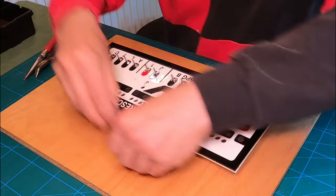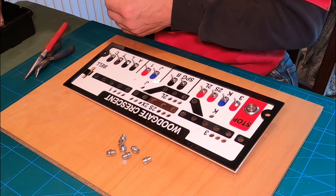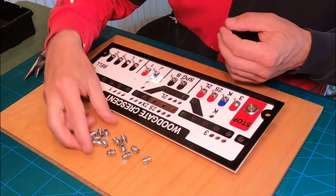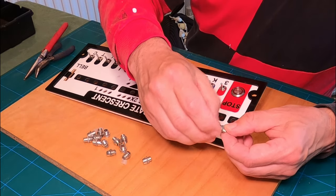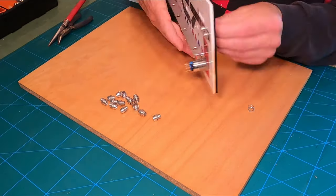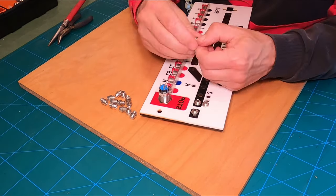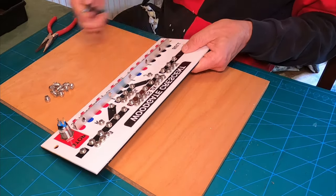With the row of switches installed, the next job is to add all the indicator LEDs. I've chosen to include metal bezels as these will help shade the LEDs in the sunshine, and I just like the effect that they have on the board. Putting the bezels in first, they're in groups around the track plan. The ones along the track lines are track occupation indicators. These will be white LEDs.